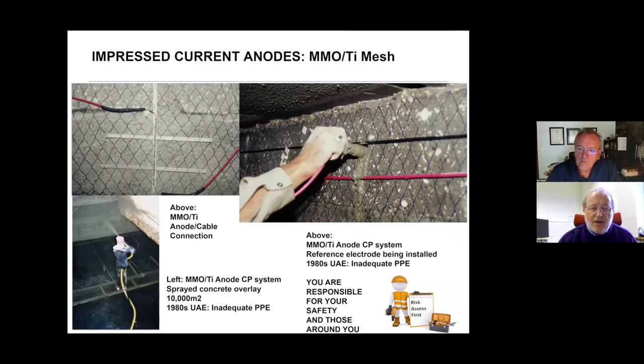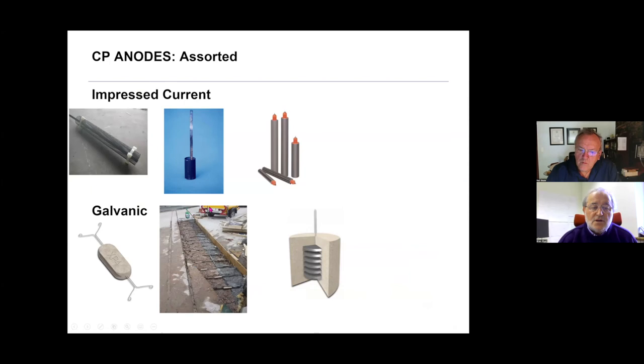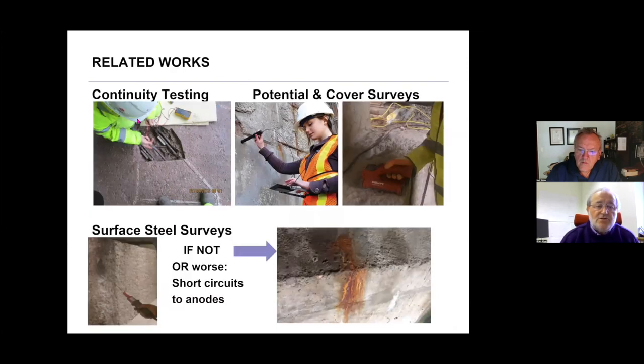The first thing that goes in repair areas is the wire, so you can lose continuity in repairs. What is done there is that every area of repair is fully tested for continuity, and where necessary bonds are made to ensure it. In bridge joint areas there has been continuity testing and bonding. Here we see continuity testing in a small selective repair area.